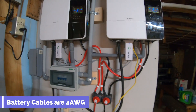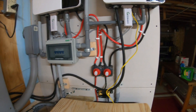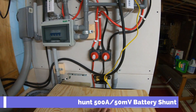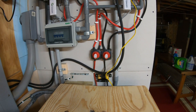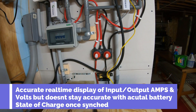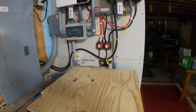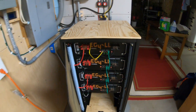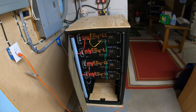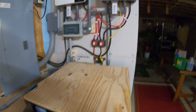My battery cables come into a DC quick-disconnect, and I have a Victron battery shunt here. Honestly I don't like it very well — it's hard to get it to sync correctly, it automatically unsyncs and gives me all kinds of hassles. If you really want to see what's going on with the batteries, you're better off connecting to the RS-485 port and running the application directly.